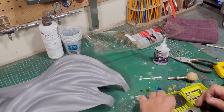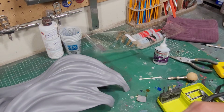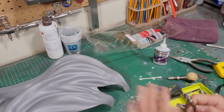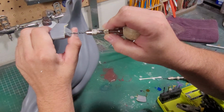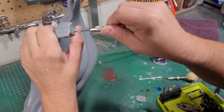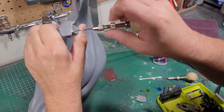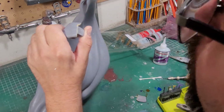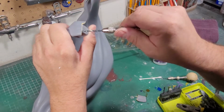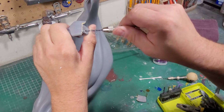This is the right size, 3/32. All right, let's see if I have enough meat in here to do a 3/32 inch hole. Hopefully I don't crack out the... And every once in a while I'll take the drill bit out and clear the dust, because as that dust builds up in there, it puts stress on the hole.